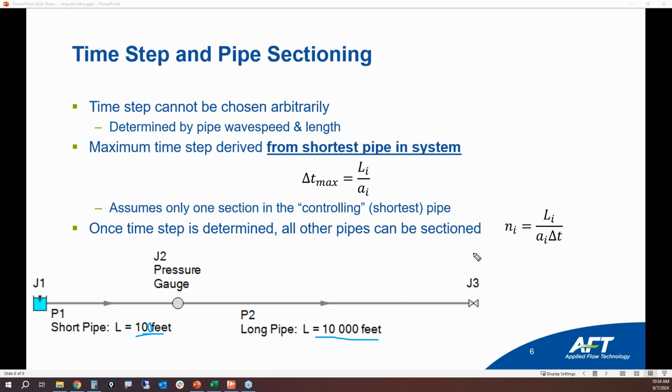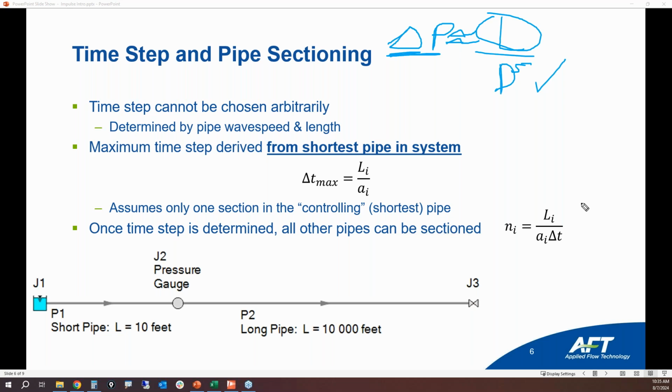results very much. Why? Well, A, if you are considering the Darcy-Weisbach equation, the FL over D times 1/2 rho V squared and all that good stuff, the thing to remember is that your pressure drop in the pipe is proportional to length divided by diameter to the 5th power. So as long as your diameters are correct, you can make your pipe length a little bit longer arbitrarily, and it's not going to make a significant impact on your pressure drop.